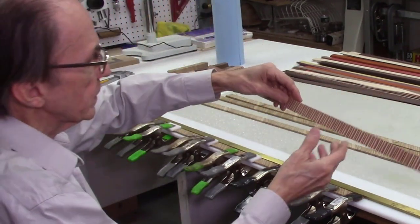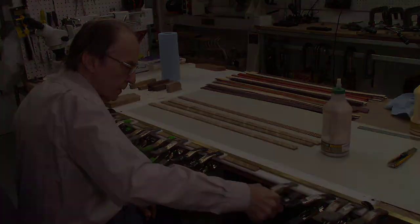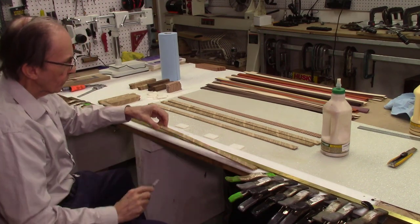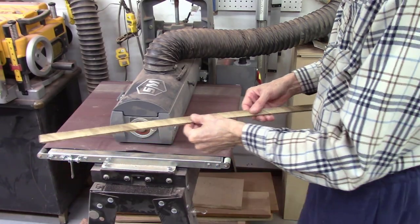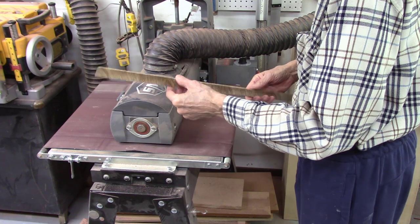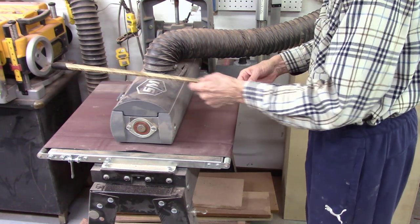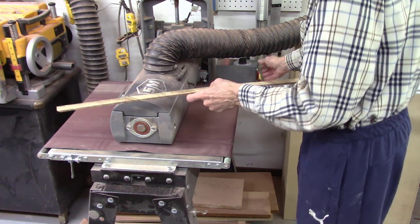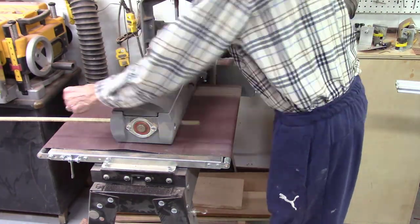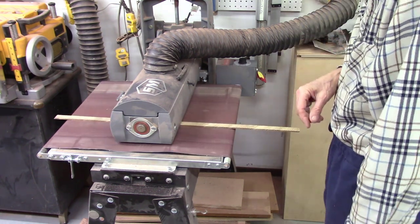Let that dry for about an hour — that's fast, quick and easy to do. The joints will be nice and flat and when you sand it a little bit it cleans up nicely. After drying for about an hour I can remove the clamps. After these strips have been glued together I need to run them through my board sander just to get rid of the glue marks and level out the surfaces — taking off only one or two thousandths. I handle these very delicately because they are very fragile. I set the board sander to the approximate depth of the piece, reverse the board and take the second side without changing the depth setting at all.